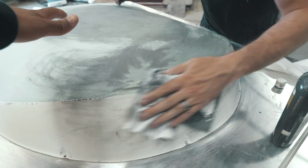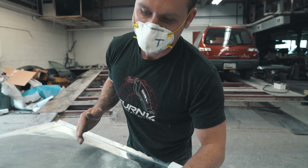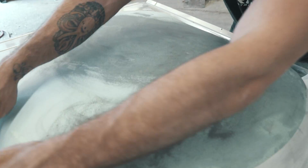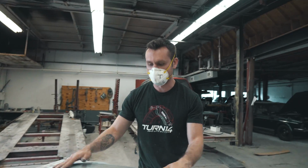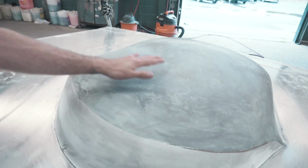But you still want this perfect, I guess, for the resin seepage or something. Yep. Because I'll probably pull vacuum from the center, have the resin come from around, and flow across the part. That way I've got a big buffer between where I can have the resin stop. So we have everything smooth.